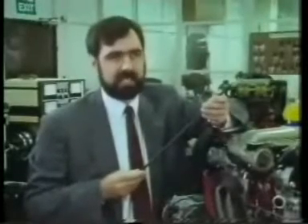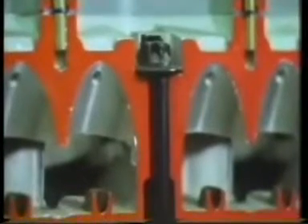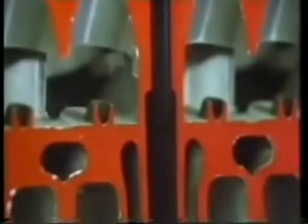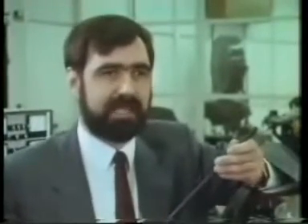The tunnels gave us relatively large area — they're actually square — large area communication passages between the crankcase itself and the cylinder head. We decided that we could use these as passages for engine breathing, and it also allowed us to provide a much better oil drainage system from the cylinder head back to the sump. It wasn't something we had envisaged at the beginning. The need to enclose the bolts to ensure oil tightness gave us this opportunity, which was a significantly greater benefit than we would have originally obtained by running the bolts externally.